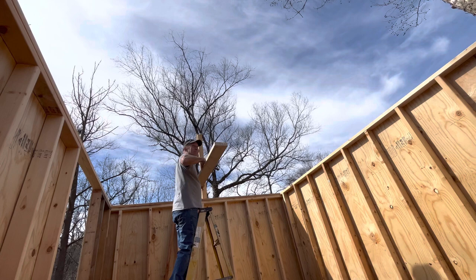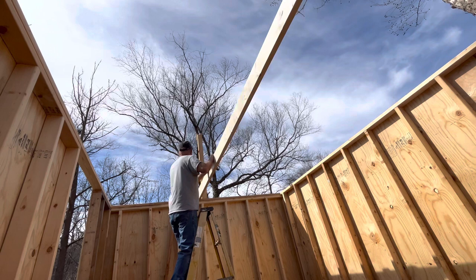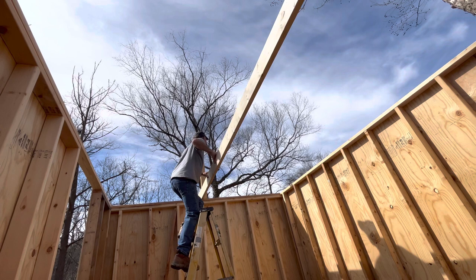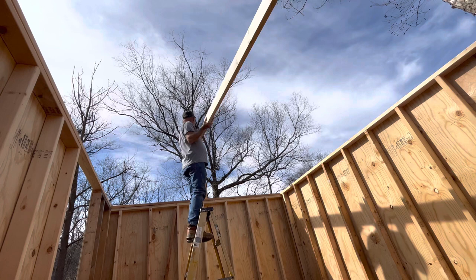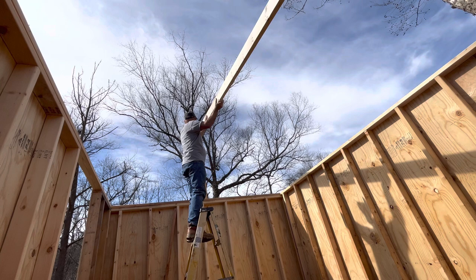The building is 10 feet wide and the rafters that I'm going to be using are 8 feet long. This head beam will stick over a foot on either end and the rafters will stick a foot off of the sidewalls. Easy enough if it don't fall.